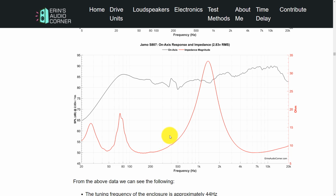definitely gives you a pointer, and you can almost always see it in the frequency response as long as the resolution of the measurement data is high enough in order to see it. What I mean by that is if you have a poor resolution frequency response that only has a data point at 200 hertz and then maybe 600 hertz, then obviously I'm connecting a line between two data points. I'm not going to see all the other data points in here. That's one drawback to doing the typical far field measurement that people do in their garages or their homes.